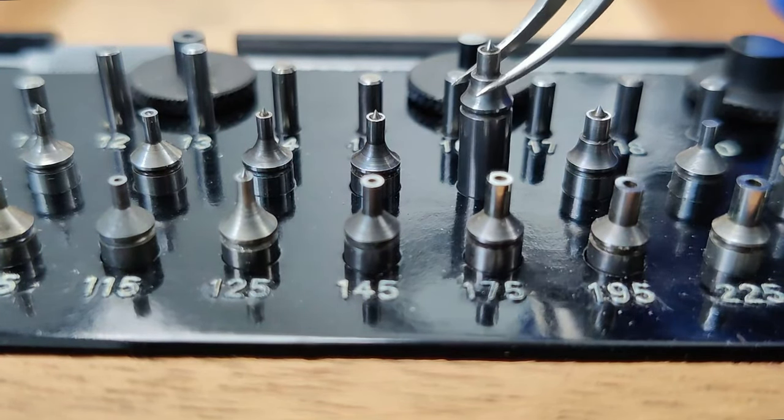Let's set the train of wheels, beginning with the escape wheel. Okay, and this is the fourth wheel. And of course, the pivot of the fourth wheel holds the seconds hand from the other side. Now we'll get this train wheel bridge screwed down. Okay, great. The wheels spin freely, as they should.